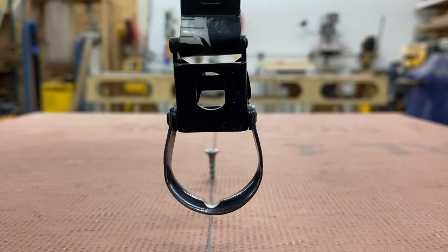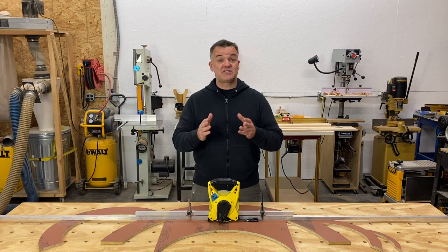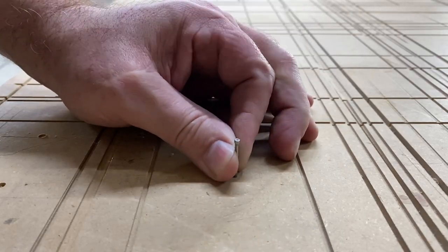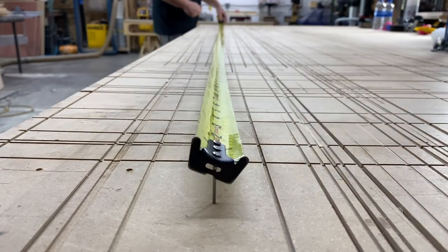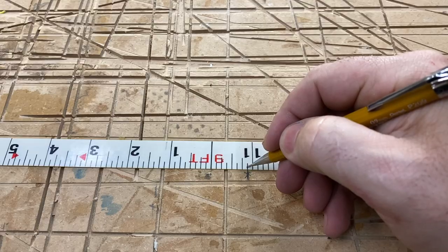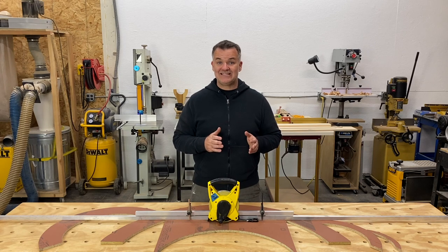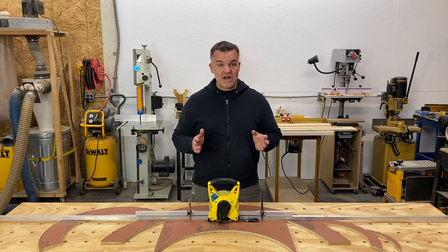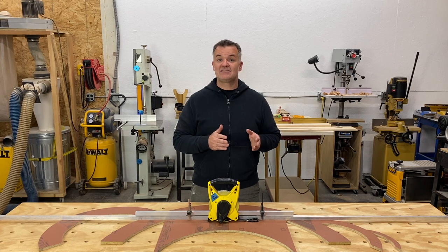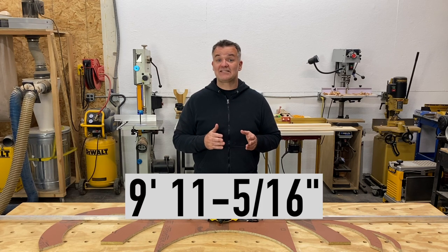I like to use my 100-foot tape for large radiuses. The end of the tape has a ring that I've filed a notch in, allowing it to rotate evenly. Before we can use the tape, we need to find the offset that the ring causes. Set a nail on a flat surface and measure out as far as you can — the further the better. I marked nine feet, then hooked the ring on the nail and checked where it lands on the mark. The difference is your offset — in this case it's seven eighths of an inch — meaning whatever the radius, I will mark seven eighths less on the tape.